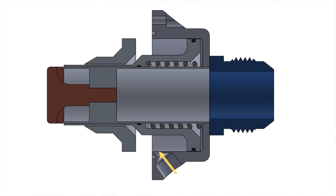I've been thinking about doing a video on fittings, tubes, and pipes for a while now, so let me know if you'd like to see a special on flared fittings. To recap: gas will come in through this AN fitting, then push up on the pintle sleeve, opening it and allowing propellants to enter the combustion chamber — that is, unless the gas goes somewhere else. Gases, and in fact any fluid used in rocket engineering, are notorious for being anywhere except where you need them to be. If you give them the tiniest opportunity, they'll escape and complicate your life.